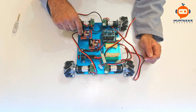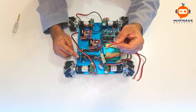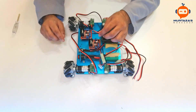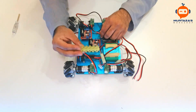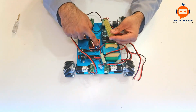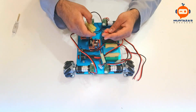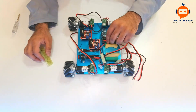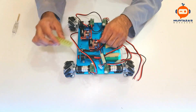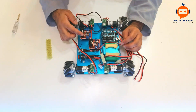The other cable we have to connect is the power cable. We are getting 12 volts and ground, which we have to connect here. We have two of these, so what we can do is connect it to one of our connectors — we will connect this here, and over here we are going to have four wires: two of them will go here and two of them will go here. This way the ground will be connected as well to each other and we will be able to share the cables. We are not putting it directly here because these connectors are not that big and it would be hard to push those in, so we are using this instead to combine these two together and then split them easily.